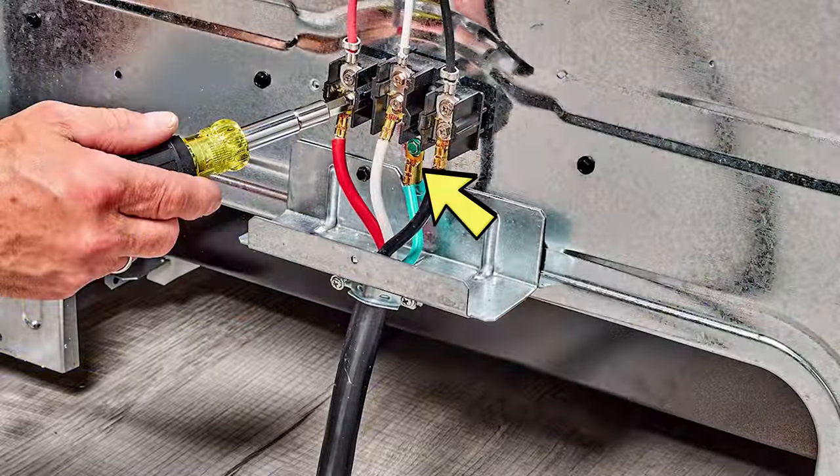Basically, we have to connect anything metal around electrical equipment just in case something happens. Sometimes terminations come loose, things overheat, conductors break, or terminations go bad in an electrical circuit. Problems almost never happen in the middle of the circuit — they're always at a termination point or a problem spot. The vast majority of the time out in the field, it's always at a termination point where heat is starting to build up because of a loose termination or something failing in that circuit. When we bring conductors out to a piece of equipment, the ground always runs to the metal surrounding that equipment.